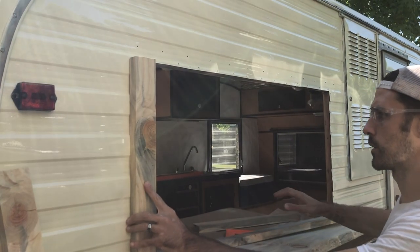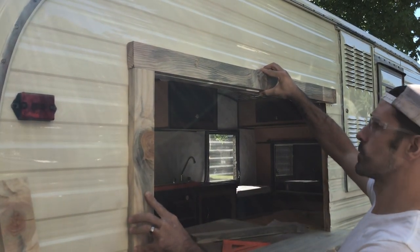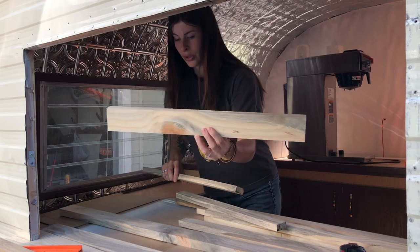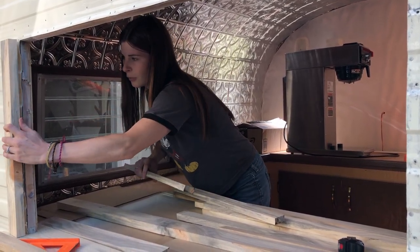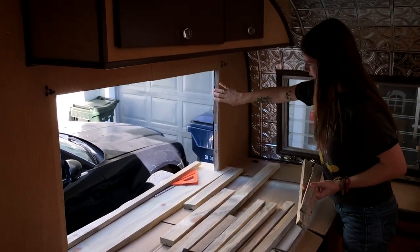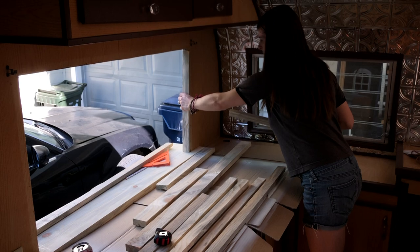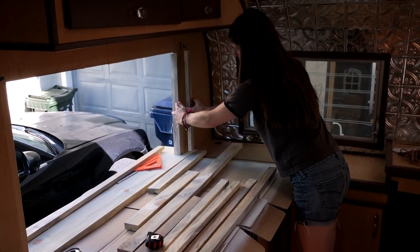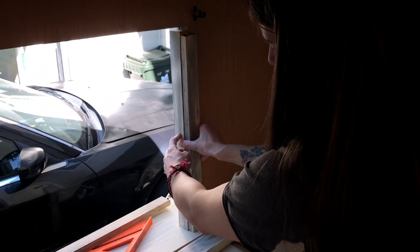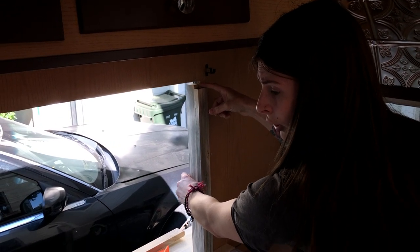Basically we're just going to have a pillar here and another pillar over here, and this will sit across the top here like so. On the exterior we're using a two and a half inch piece of wood. When the window closes down, it's going to sit within this groove. We have the exposed edge from when we removed the window that we're going to cap off with this one and a half inch piece, and on the interior side we're going to cover this seam with another one and a half inch piece. That creates a flush corner and hides the exterior edge.